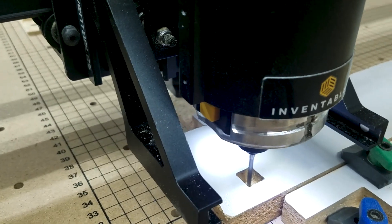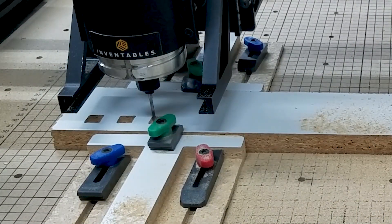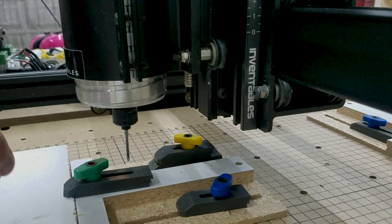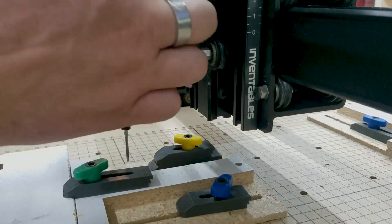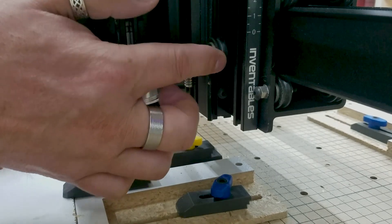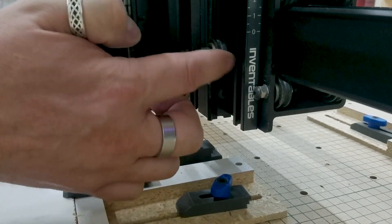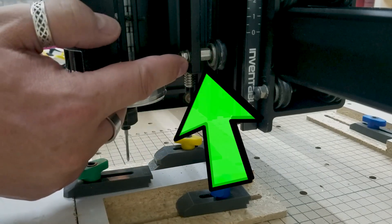After this stage carve, I needed to look and see how well my belts were and if any of the wheels were a little too loose. One of the things we want to check when we get these dog bones is to make sure this isn't loose by checking these wheels. I can tell you right now, that is way too loose — it should not be adjusting like that. So we'll have to get a wrench in here and adjust it.